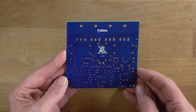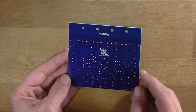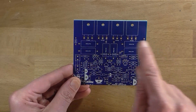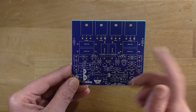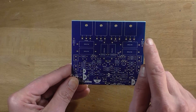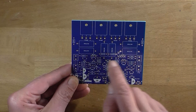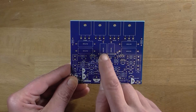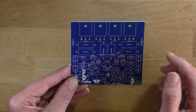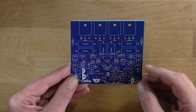There's the bottom — we like bottoms on this channel — nice thick copper traces for the high current side. I don't have the aluminium bracket to mount the transistors to, and I don't have the output transistors. However, this amplifier will still work without the output stage connected. It will pass a signal, preferably unloaded, because the emitters of the drivers go through these two degeneration resistors back to the output point. So we can pump a signal in, see if one comes out, see if the bias adjusts, and see if the offset null adjusts.